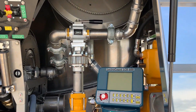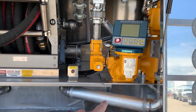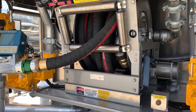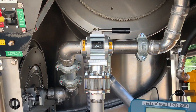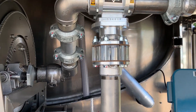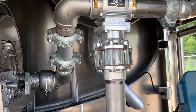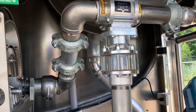Over here you can see the diverter valve. This diverter valve for the 3-inch system lets you decide whether to go to your curbside hose reel door or out to the high-speed center hose reel. You can also see the sight glass here — if you're switching from clear to dyed fuel, you can see what product is making it to the hose reel, which helps eliminate any mistakes.